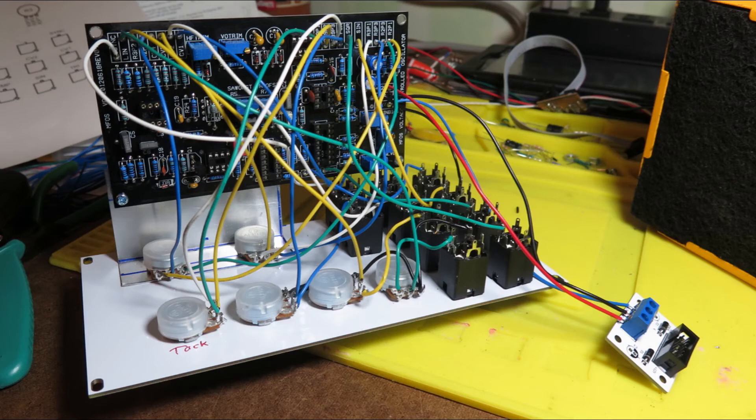The ICs were installed and the power rails were checked for shorts — none found. Power was applied and the ramp output appeared immediately, along with the other outputs. They were pretty ugly until the trimmer pots were set to roughly the right values. Testing the pulse width showed it behaved much like on the breadboard: the pot limits were reached before the pulse wave shut down, meaning the narrowest and widest possible pulse widths were not achievable.